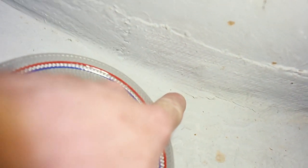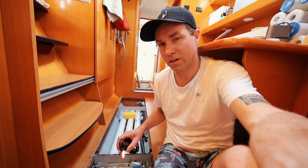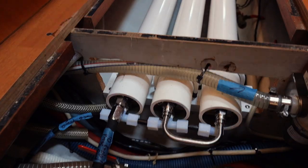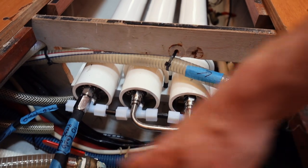This is something every boat owner should do: get in there with a flashlight and start inspecting their bulkheads. They should inspect every little piece of their boat if they're going to take it offshore — to see if it's changed, to see if anything's broken, to see if anything needs to be upgraded, to see if anything has moved. So what we're going to do is glass all the way around this partial bulkhead to make it stronger than before.